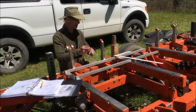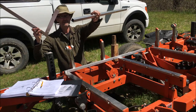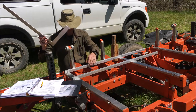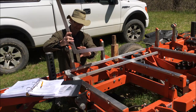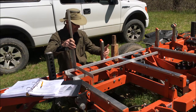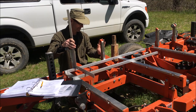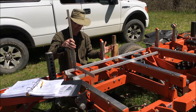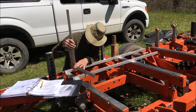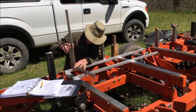A final check — 8.7, 8.7. So horizontally, this one is good. Now we'll do the vertical check. I've got two square cross-section aluminum rods or tubes — these don't come with the mill, you have to buy them separately. I put my square on them; these are on the bed of the mill. I want this surface to be perpendicular to the bed of the mill, or at the top up to 0.8 millimeters towards you. When I put this on here, I'm very close to vertical.